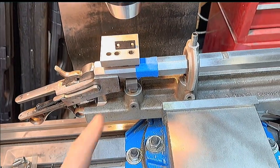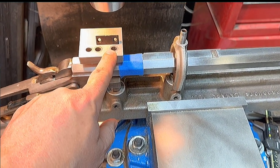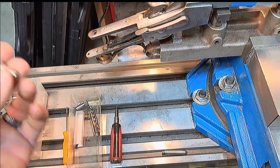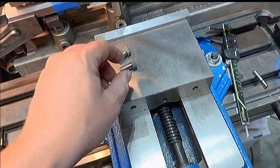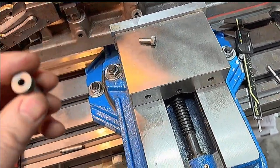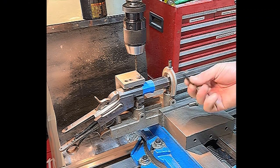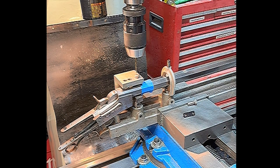Now that we're set up in our jig, we're lined up on our first hole. I've double checked to make sure that the spacing here for our Forester drill and tap jig matches the Unertl rear bases that I have. And we're going to select the correct insert for 6-48 drill and tap, which the drill is number 31, which matches the drill size we need, the number drill size, and the tap will be a 27. I always like to double and triple check these hole spacings because once you put a hole in, you can't take it back out.